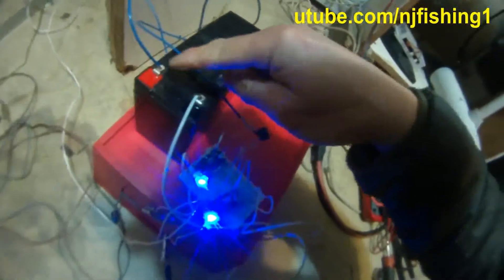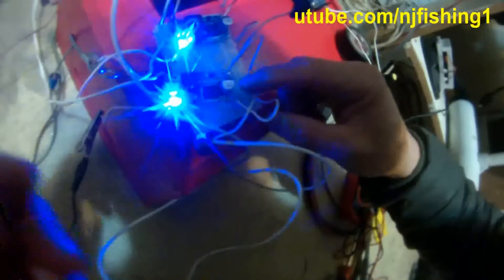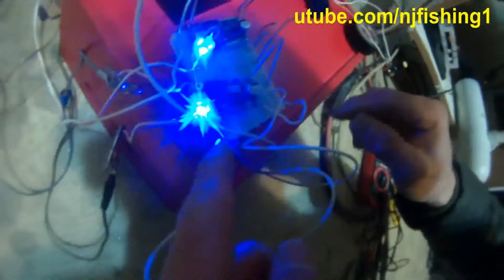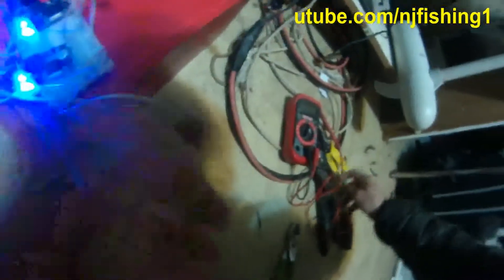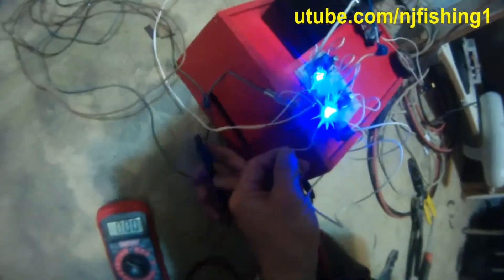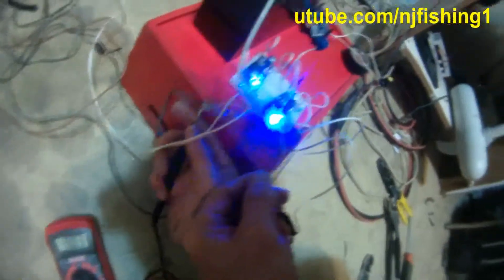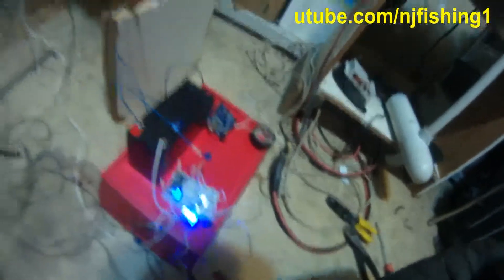This takes the 12 volts power because these are 12 volt regulators. If I check the voltage at the input terminal of the regulator it should say 12 volts, but when it comes out I have it converted to 9 volts. There's a button here — when I insert a screwdriver I can turn the knob to adjust it. I'm connecting positive and negative and it should read 9 volts — you can see there: 9.03 volts.